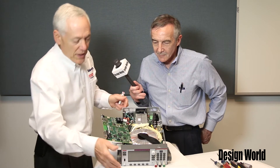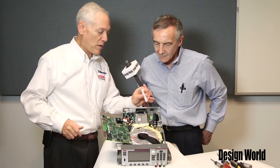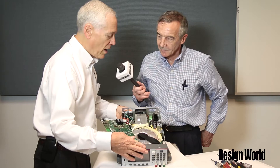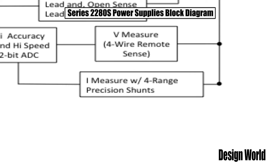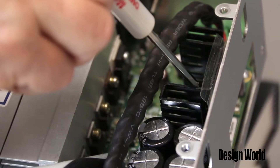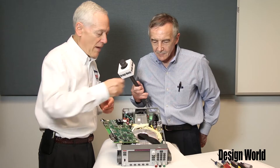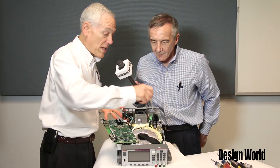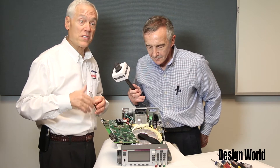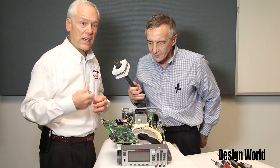As well as the front inputs, we have rear inputs. You can see the green multi-pin connector on the back. The main sensitive circuitry is by the rear inputs here. We need to measure — we can resolve as low as 10 nanoamps of current. And we have a very large, physically large shunt resistor over here with a substantial heat sink on it. So again, to keep it cool and stabilized so we can make these low current measurements and not have thermal issues affecting our accuracy.